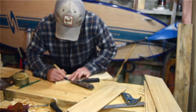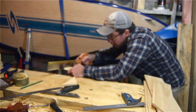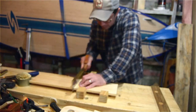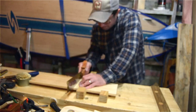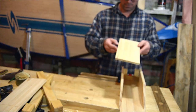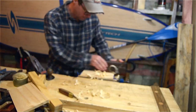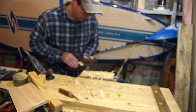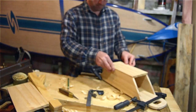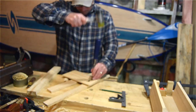I put a 30-degree angle slope for the top piece and sawed out both pieces. I clamped the two pieces together and used a coping saw to cut out the quarter moon shape on the bottom, then started to form the front, which I also used my moving fillister plane to create rebates on. That front also needs a hole in it that's big enough for your hand to reach in and pull out a plastic bag.